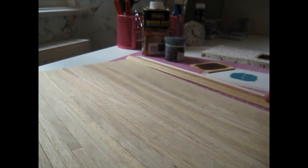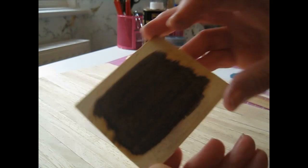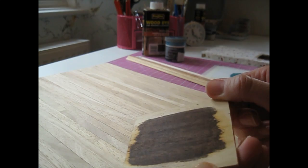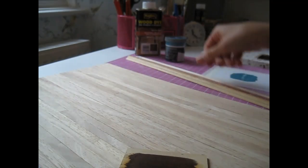I'll be using the wooden strip flooring again, doing the same thing as I did for the study floor - creating a cardboard template and then stripping the strips apart. These are on a self-adhesive backing. I'll reapply them to the cardboard template, which I think looks more natural. I'll be finishing them with a walnut wood dye - two coats shown here - and then adding a coat of clear varnish for a nice sheen. I'm using Rustin's walnut wood dye.